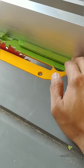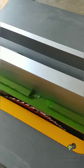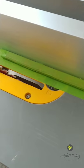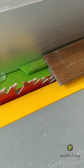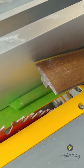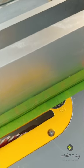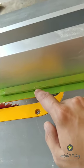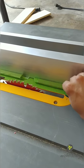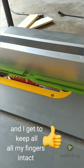What I've done is put some painter's tape around the pencil and on the surface of the table, then I took my T-molding and adjusted the fence to make sure the blade teeth are cutting at the right place — right here in a straight line. Once I set up the fence, I took super glue and super glued these pencils to the tabletop so they're not moving. They provide support to pass the T-molding through and make that cut.